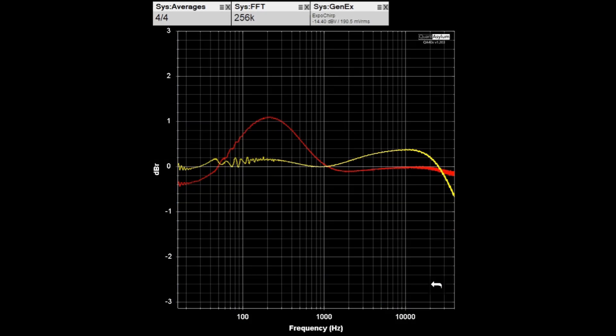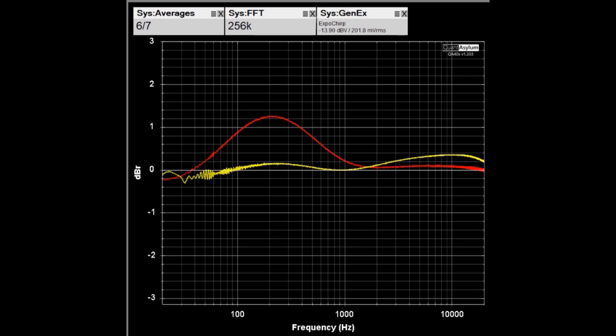Here are the HF-12s' frequency responses from 20 Hz to 20 kHz at about 1 watt into 8 ohm loads, per the specification of plus or minus half a dB. We're really not too far from that. With the left amplifier we're down maybe 0.6 dB. With the right amplifier there's a hump around 200 Hz that's a bit over 1 dB. I adjusted the bass and treble controls as best I could to get the flattest response, and for the right amplifier this was about as good as I could get — overall, not tremendously bad for something this old.